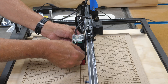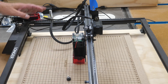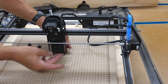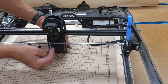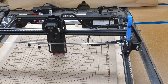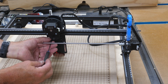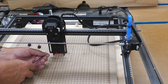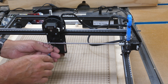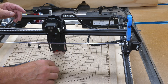Simply take these two knobs loose that hold the laser module in place — that's what I use to focus. Then there are two smaller allen screws right there that you'll need to loosen up and remove. That lets it ride up and down in that track. Now you've got to find the right size for that — that's two M3s if you're keeping score. There's a nylon spacer in there — don't lose that, you're going to need that. I'll put them back on the screws so we don't lose them.